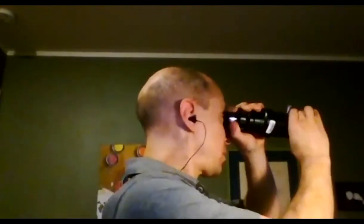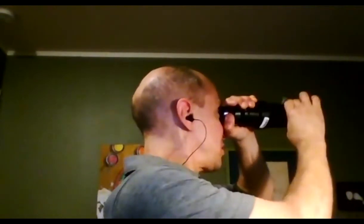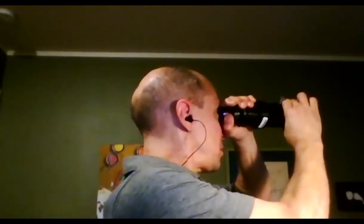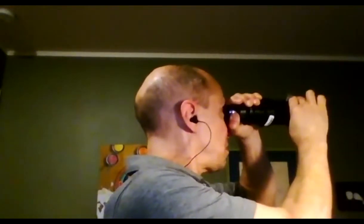You put your PVC into your telescope, you focus it on something. Okay. And now take a look. How sharp is that image? Does it look good? Does it look blurry? Now what I want you to do is take your PVC out, flip it over, putting the lens in backwards, refocus, and tell me if the image looks sharper or blurrier. Ew. Yeah, in my case, it's blurrier. So I'll flip it back around, do it right.